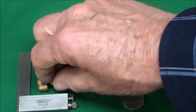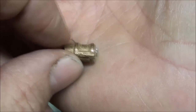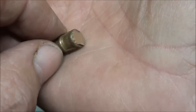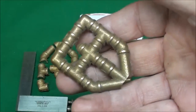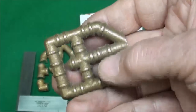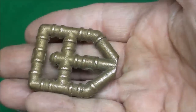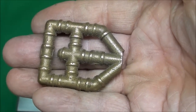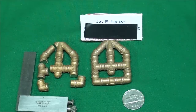I think I'll start with the simplest, which is going to be a coupling. These are brass or bronze - probably bronze - I'm not really sure because it's not real yellow, it's a little more brown, and I'm sure it's free machining. They were probably investment cast, but it's irrelevant - it should be pretty free machining. Thanks Jay, I hope I can do these justice. I'm not doing all of them since I don't have a use for them right now - just doing it as a challenge and something to show on my YouTube shop tips.